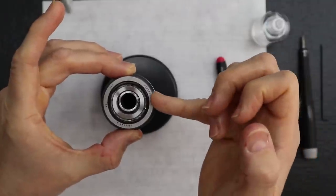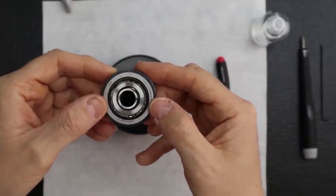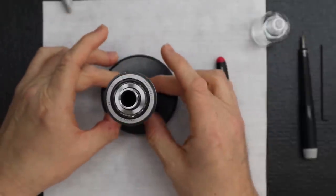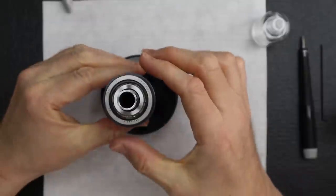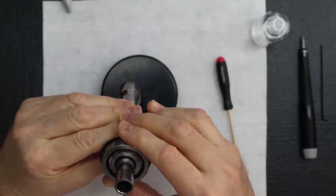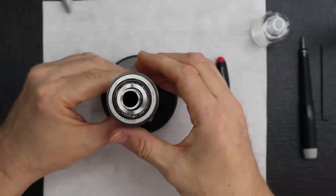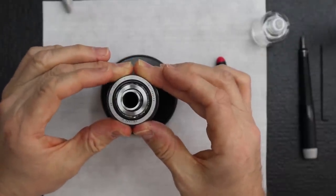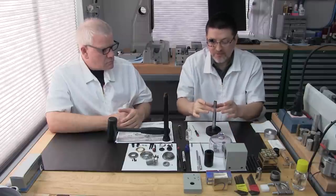Okay, and also the arrangement. I've got the writing, or the back of the bearing, facing up. Okay, let me just double check. There, now let me, just a little off. So you just take your time. Perfect. And what I like to do is, once I've got the position correct, just put a little downward pressure, just lightly. I like to rock it a little bit, because we don't want to get started off on a little bit of a cocked angle. I don't want it to be angled like this and then press it on. So I kind of just rock it back and forth.